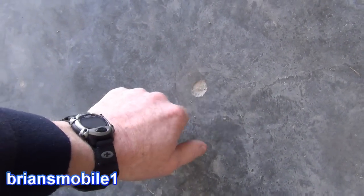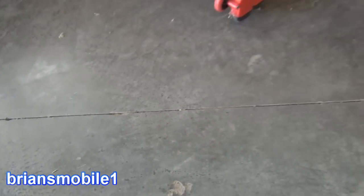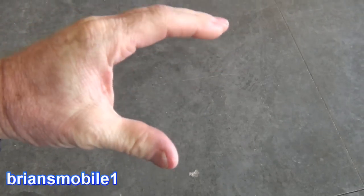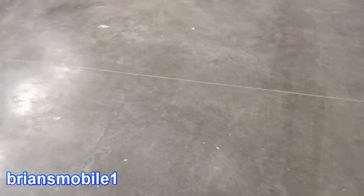Out here I don't see a whole lot of chipping and spalling, but here I do — this area cooled down and I've got some pretty big spall spots just about everywhere. Not the end of the world. There was a lot of spalling in these areas because the concrete blankets blew away and there was just nothing you could do about it. I would have had to double or triple layer them with support, but the problem with support is when you put stuff on top it causes the blanket to not insulate as well. Insulation does best with that layer of air to prevent temperature from moving through — if you compress it, it loses R-value. Overall I'd take this floor over most any others I see any day.